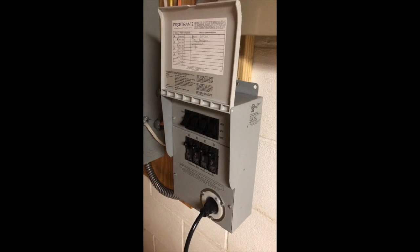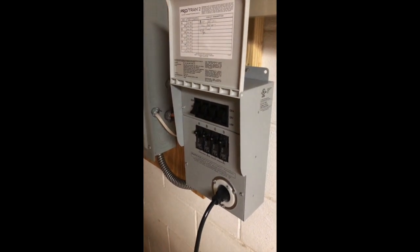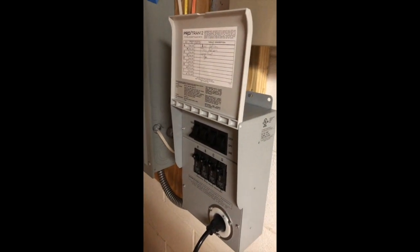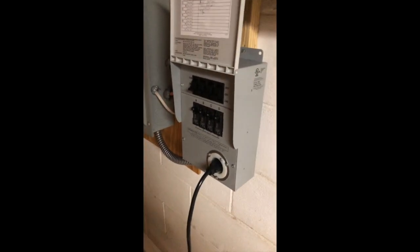I calculated I would have about four to six hours worth of power — six hours if it's during the daytime and it's sunny, because I would get power back to the battery; four hours if it's nighttime and everything goes out. It's pretty cool and definitely worth it if you want something to back you up. Critics will tell you it's cheaper just to get a gas generator, which is true, but it requires gas, you've got to change the oil occasionally, and make sure it starts up every year. This system is static, so you literally just have to keep it charged to 100% most of the time, and occasionally run it down to about 80% and recharge it back to full. I enjoy using it.